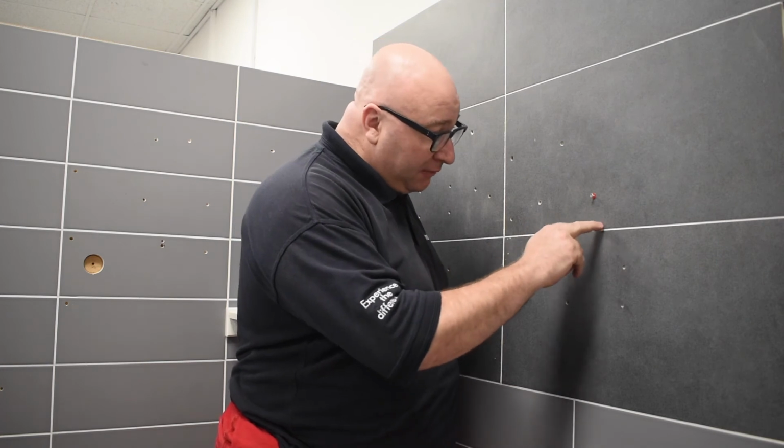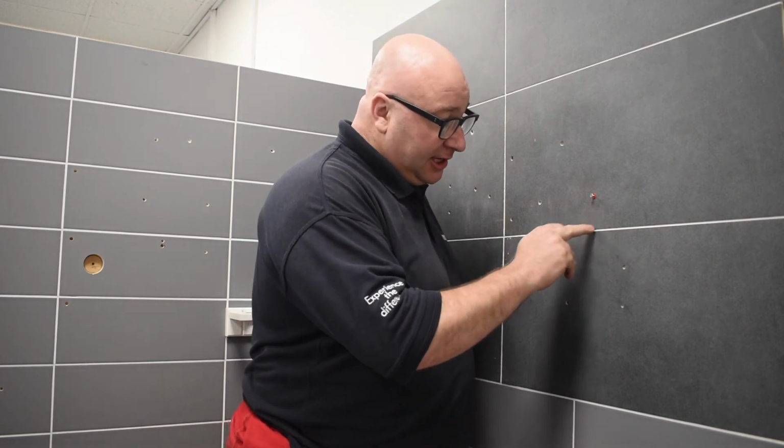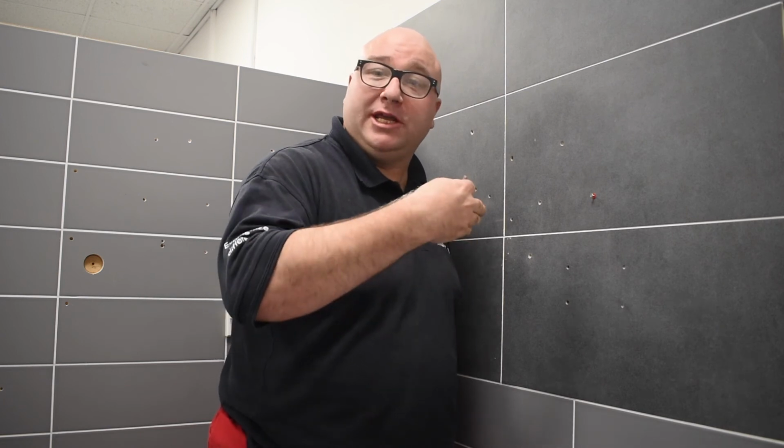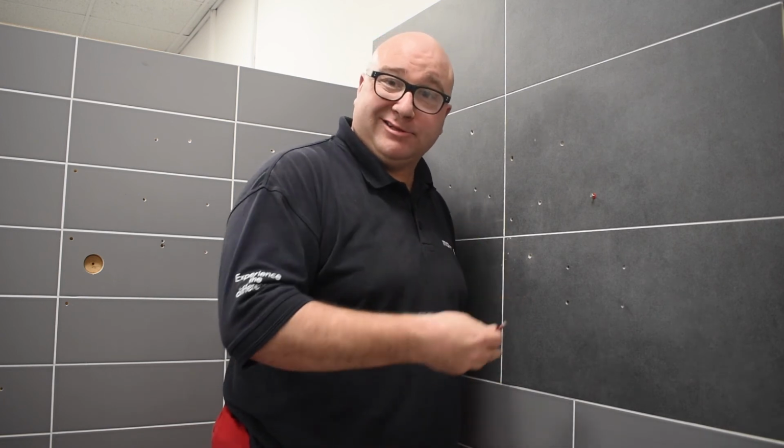A few things to remember when drilling with the PG750X. We want to be careful where we drill. Closer to the edge, we need to be more precise. Keep the oscillation small. Also, don't worry about the heat, because the PG750X is wax filled. We use the heat generated from the drill, that's why we need 2000 RPM. This melts the wax, coats the tips, and keeps it drilling ready for next time.